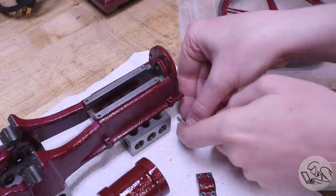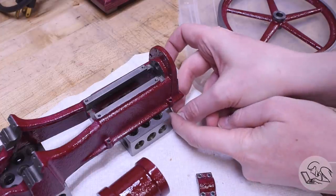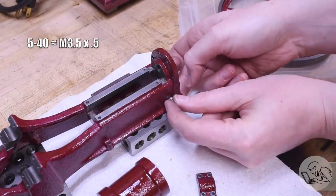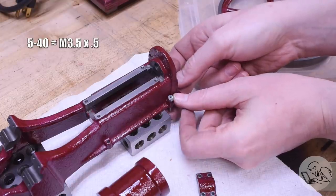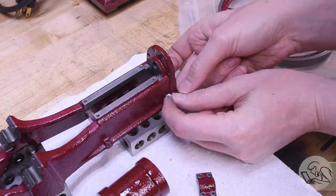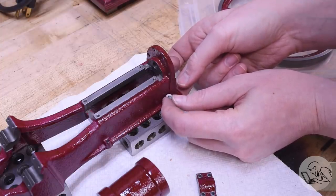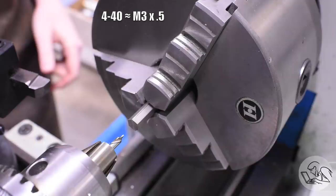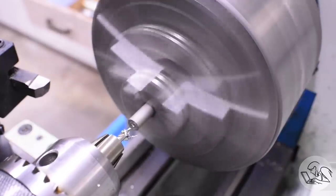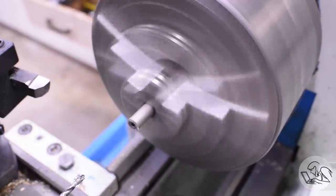We'll do a test fit on the engine though, and the stud is kind of a tight fit in that hole — I'm not crazy about that. And the nut, which is a 5-40 nut, which is what I made the threads, does not fit — it does not clear the casting. That is unfortunate; I just assumed this would be 5-40 hardware. The drawing doesn't specify, but turns out it needs to be 4-40. So I went ahead and just made studs out of threaded rod, because you can buy stainless steel threaded rod in all manner of small thread sizes.